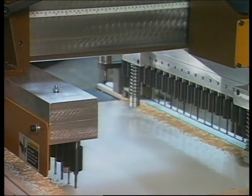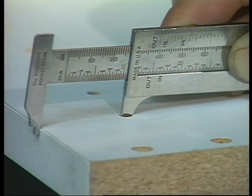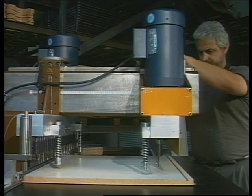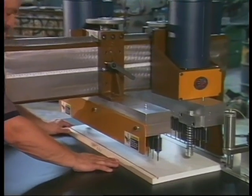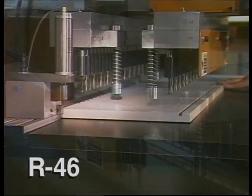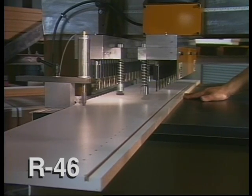Non-system manufacturers choose a standard offset suited to their needs. Industry hardware standards for the 32 millimeter system require the line of drills nearest the fence to be set at 37 millimeters from the face edge of the panel. The location of the second line of drills in system base cabinets is dependent on the placement of the drawer slide hole, as specified by the hardware manufacturers, and is set from the panel's face edge. Second line placement in upper cabinets is a matter of choice. The R46 can drill all holes required for a standard cabinet in a single machine cycle. Tall cabinets require more than 23 line holes; the Ritter R46, using the air index pins, can continuously bore panels of unlimited length.